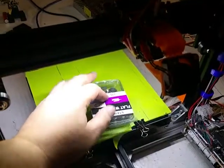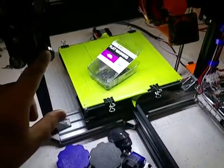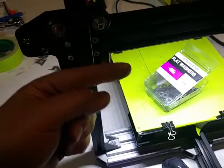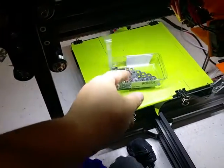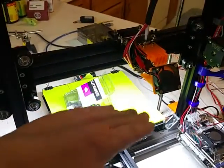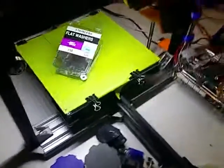I went to Menards and picked up a box of number 10 flat washers, which work really well as shims and spacers inside the wheels. Some people have taken the wheels apart for the carriages and put lock washers in between, but if you don't really tighten those down the wheels will wobble — it puts a little wave into the movement because of the split nature of the lock washer. I put two flat washers in the middle instead and things have been straight. I was having funny prints and couldn't level the bed, and I noticed the X carriage was wobbling up and down as it moved. Replacing with flat washers gave me perfect little spacers.